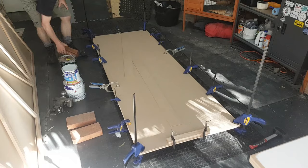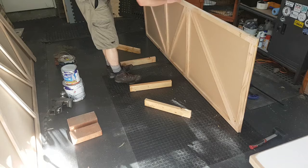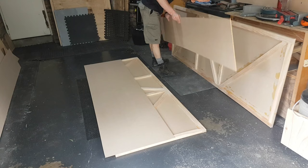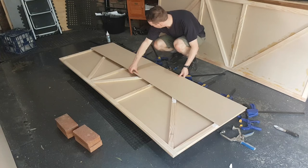Very stressful glue-up here — I don't have enough clamps to do this properly. Paint tins and bricks weighed it down in the middle. A few hours later I could check it. I had many glue-ups to do, spread over a series of days to get everything done. Also a bit of a pain because I had to scratch off all the excess glue to make sure the back panels fit on well. Because I was being a tight-ass I got away with three sheets of 6mm MDF. If I'd bought a fourth I wouldn't have had to use two separate pieces on the back — but it's the back of the door, no one's ever going to see that slight join.